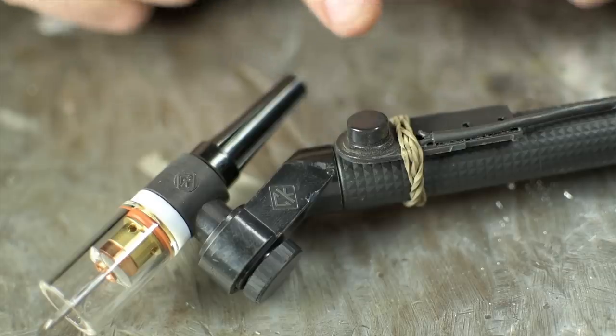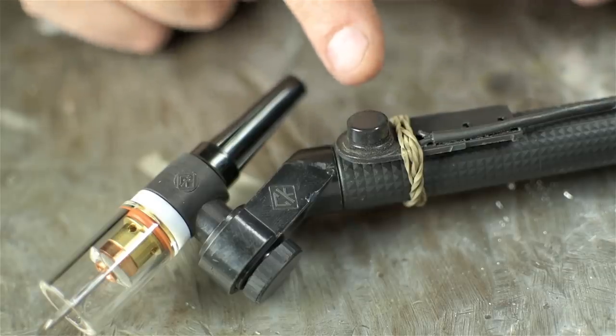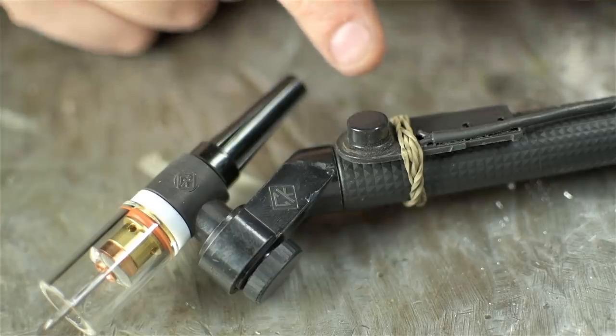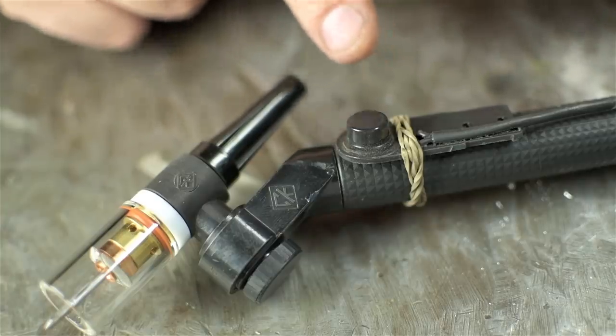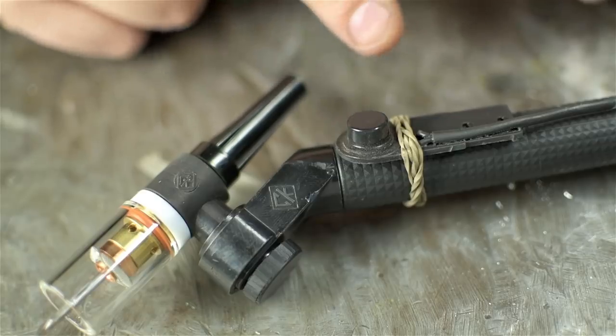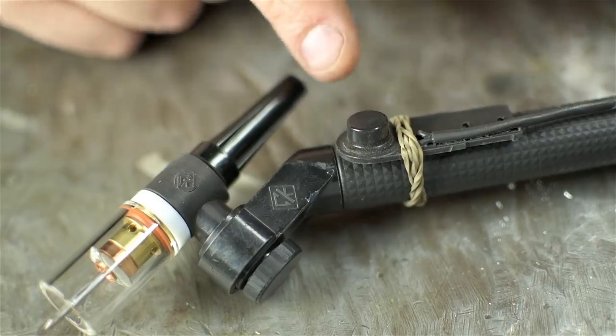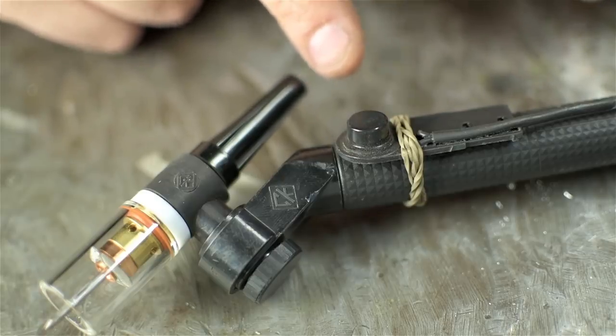Also, it doesn't take very much pressure at all to ramp this up to full amps. The machine has been set low for brazing, 70 amps or so, so I have a bit more resolution. Like 0 to full pressure is no amps to 70 amps. If my machine were maxed out, the same pressure range would do 0 to 220 amps in the case of my welder. In my limited experience, maintaining the amp setting you want isn't difficult.